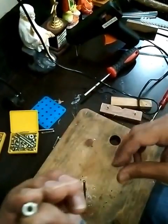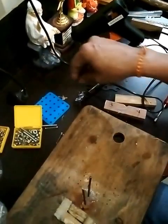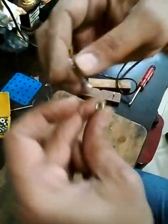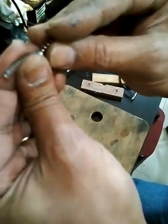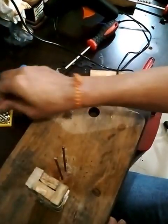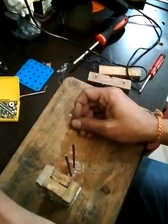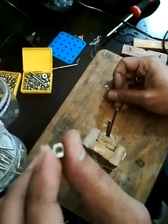This nut will work as a channel between two springs because if you put a spring on a spring there are chances it will get entangled when you press. You'll have to keep something between them — you can cut something from plastic as well.